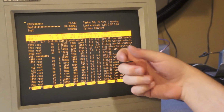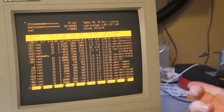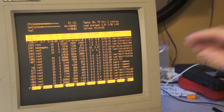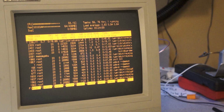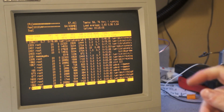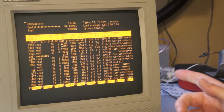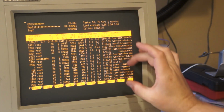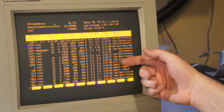It's only running at 9600 baud, mostly because I had trouble getting it running at 19200, which is mostly down to a whole bunch of settings wrong. I had local echo and a whole bunch of other stuff turned on the terminal and it wasn't responding, and I had to try and figure out what I did months ago to get all of this working in the first place. It's actually pretty fancy. It's got the slow scroll, you know, when it inserts a line.